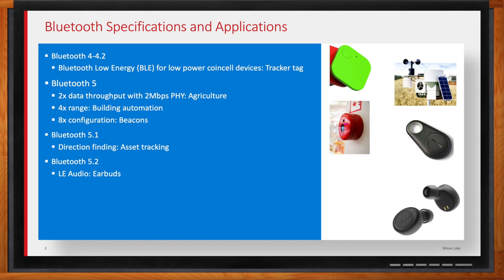Now, Bluetooth isn't the only protocol — there are others on the same band or on different bands. There's also 2.4 gigahertz proprietary, which is good if you own both endpoints. The paradigm example is a wireless mouse — the company ships the mouse with the little USB dongle, they know exactly what data will be sent, they know their battery life target, so they control both ends and don't really need to follow a standard.